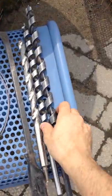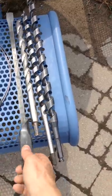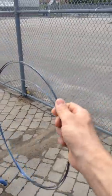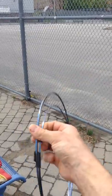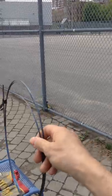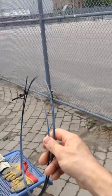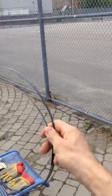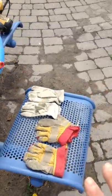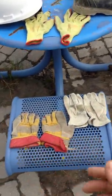We have different types of wood auger drill bits, a concrete bit, a crowbar, and a fish tape. It's nice to have a fish tape with you — sometimes you're fishing wires through openings and cavities. It's always good to have one when somebody missed a feed or you're putting in a last-minute extra.